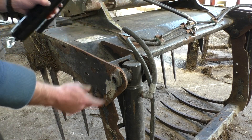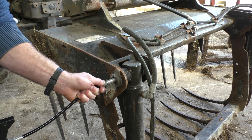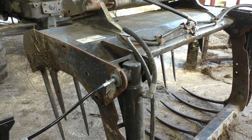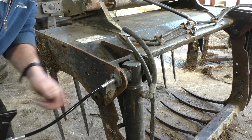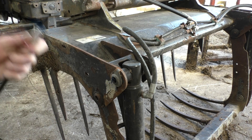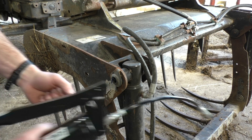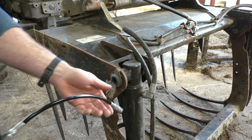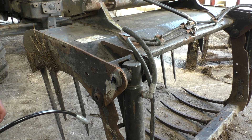We've got the loader here and we've got a couple of grease points on this. Push that in, then start pumping away — and that's working pretty good. You don't want to over-grease; a little bit of grease coming out there, that's enough. Good lock on there because you want that to be quite tight, so you've got two hands to pump. There's nothing worse when you've got to push that in and hold it with one hand and try to pump the grease with the other.